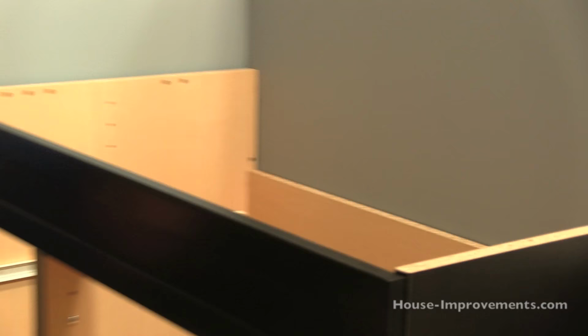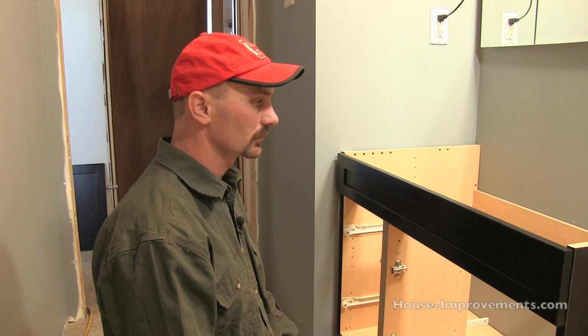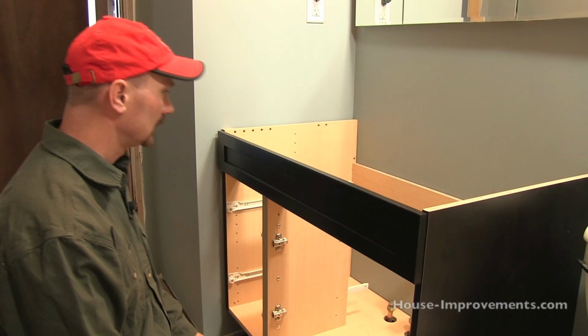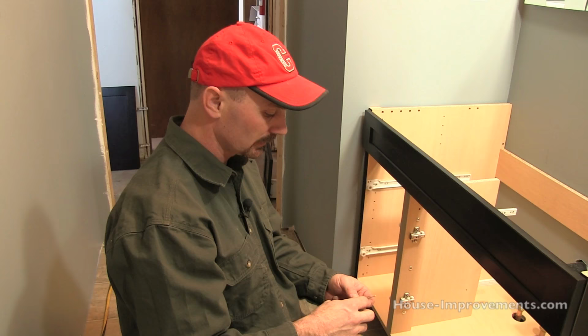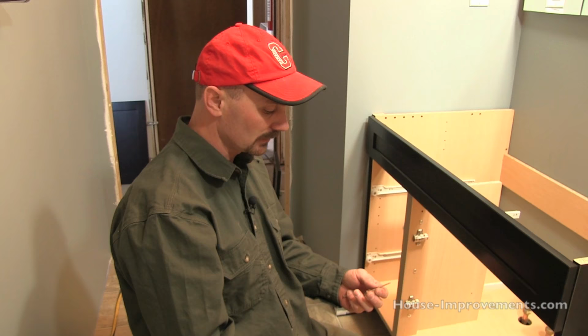Make sure before you actually put a screw into the wall that you're not gonna screw into something else, you know, electrical, plumbing, that sort of thing. We should be all right here. So, the back cleat here on this cabinet is 5/8 of an inch thick. The drywall is half an inch, so there we're up to an inch and an eighth. So I want to get some good screw depth into the stud yet, at least an inch. So I've got some 2 1/4 inch screws here, which will be more than sufficient to screw this in.